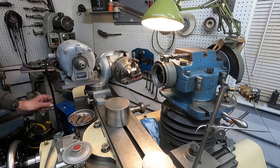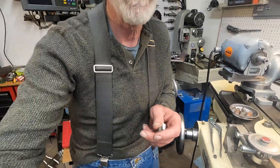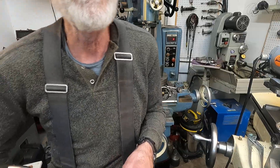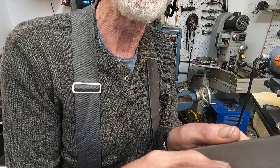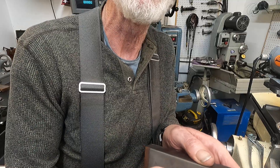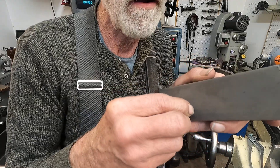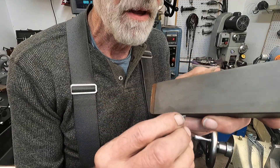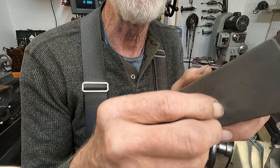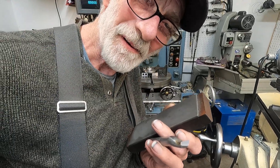Let's get over here and look at it. Here's the boring tool. I'm going to lap it and get that radius back on there - just like that - get it all nice and smooth, go over the top and get it all polished. I'll come back and we'll use it again.